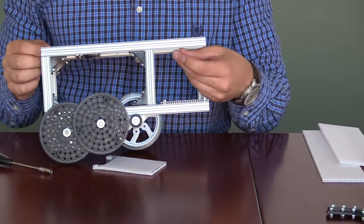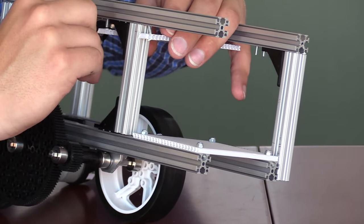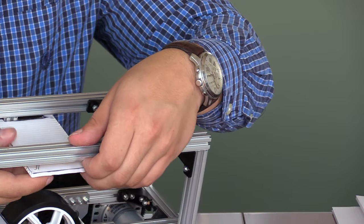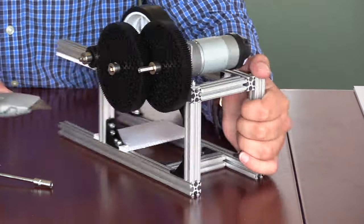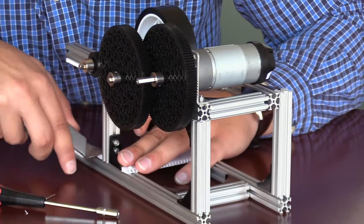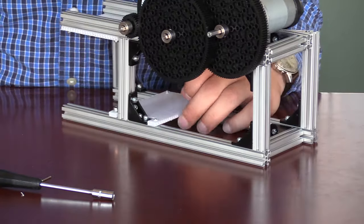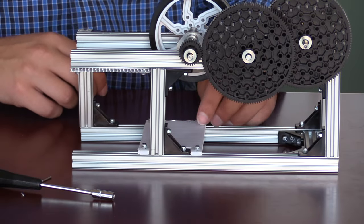For the next portion of the assembly, we will take the weirdly shaped piece of plastic that is roughly 10.5 cm x 6.5 cm. This will mount to the two bolts on the long side, as well as one bolt on the inside portion of the top piece. We will slide on an additional bolt and align these parts of the plastic so they slide onto the bolts — this process can be quite time consuming. I suggest using a small allen wrench to adjust the positions of the screws so that they all line up. Once the parts are firmly pressed together, you may need to cut a part of the plastic away using the box cutter. With the plastic piece attached, we can attach the nuts but don't tighten them down, as we will need this assembly plus that one center pillar to be able to move so that we can set it up later.